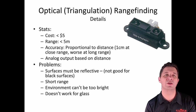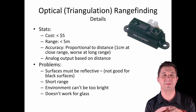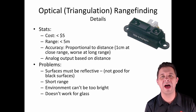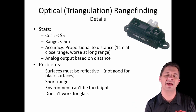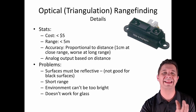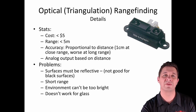There are a few problems with these sensors. First, surfaces need to be reflective. I've used them to try to detect car tyres, and the black tyres reflected very little infrared light — they couldn't be detected at all. They're also fairly short range, the environment can't be too bright, so they're not good for highly lit areas, and they don't work well on glass because the light goes through it — unlike an ultrasonic-based sensor, which would bounce off glass.